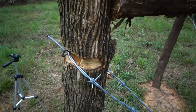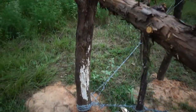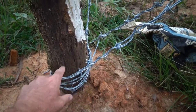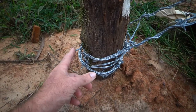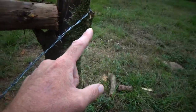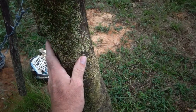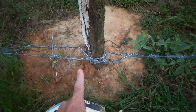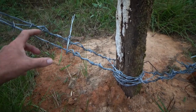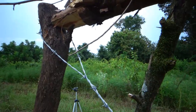Here's the little notch I cut in the other side. Starting down at the bottom of the corner post, I wrapped the barbed wire around and then twisted it. I've got a nail right here just to keep it from sliding up the post. Then I wrapped the barbed wire up to here and hooked it on this notch — this notch keeps it from sliding down the post. Then you take the other side of the barbed wire down, wrap it around, and twist it up, and that holds it. You end up having two layers of barbed wire going up to this post.